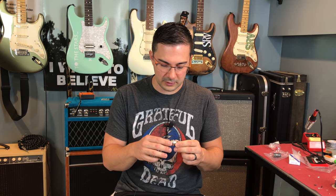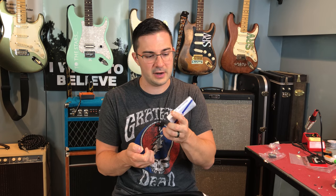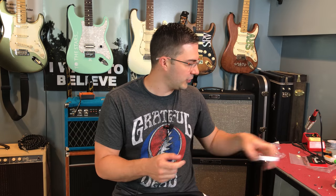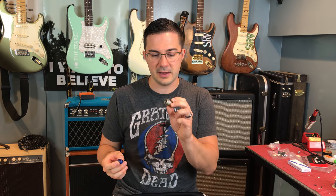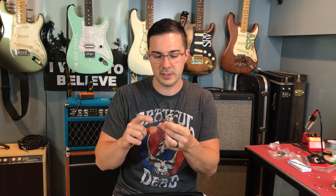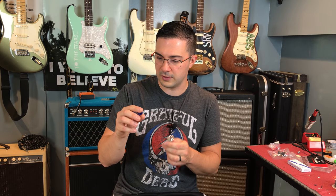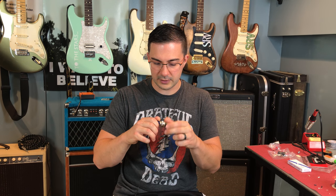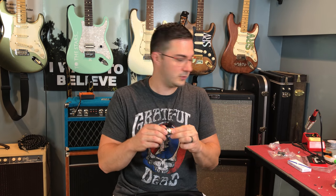It works good, but I couldn't tell if my amp was on or off during the outdoor gig. This might help too — it's about as bright because it uses the same light bulb. It uses these Fender 47 lamp style, or T3¼, 6.3-volt lamps. So I'm going to wire it to the heaters. This is a Dialyte 135 series, and this is a Dialyte socket holder for a T3¼. The only difference is the threads on this are 9-16-24, and according to the data sheet, this one is 9-16-27. I don't know if that was a typo or legit, but they screw together real nice and don't wiggle around. It feels solid and it works.